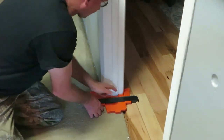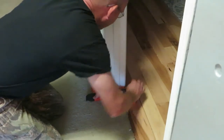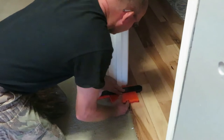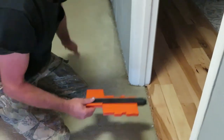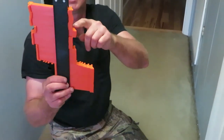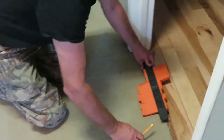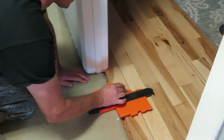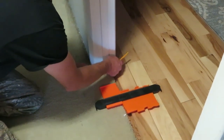Actually it would start right there, so I'm going to lock this one. Right here — put down another board. This is where we would start our contour on the next board to go around this door jamb. We'd take our piece of floor, set this on the piece of floor on this edge going up against it, and then we would trace around here.